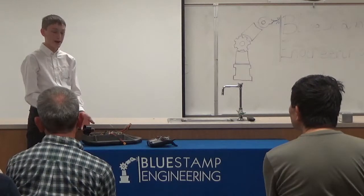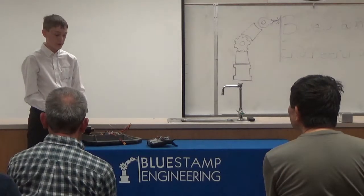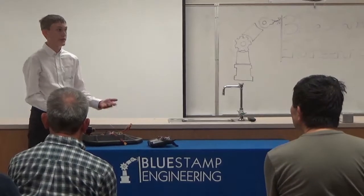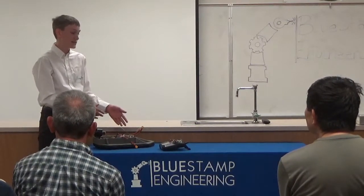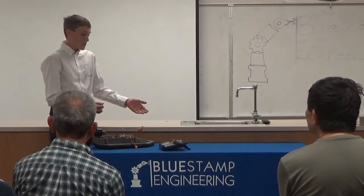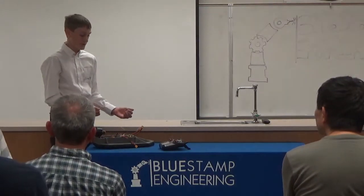I also have a servo back here. This servo rotates the thrust fan, and that rotation determines how the hovercraft turns. The servo is powered and controlled directly by the receiver, unlike my DC motors, because they have a different powering system. The receiver gets its signals from the transmitter via radio waves. It then converts these into electronic signals using a preset standard key that is already encoded in the receiver.